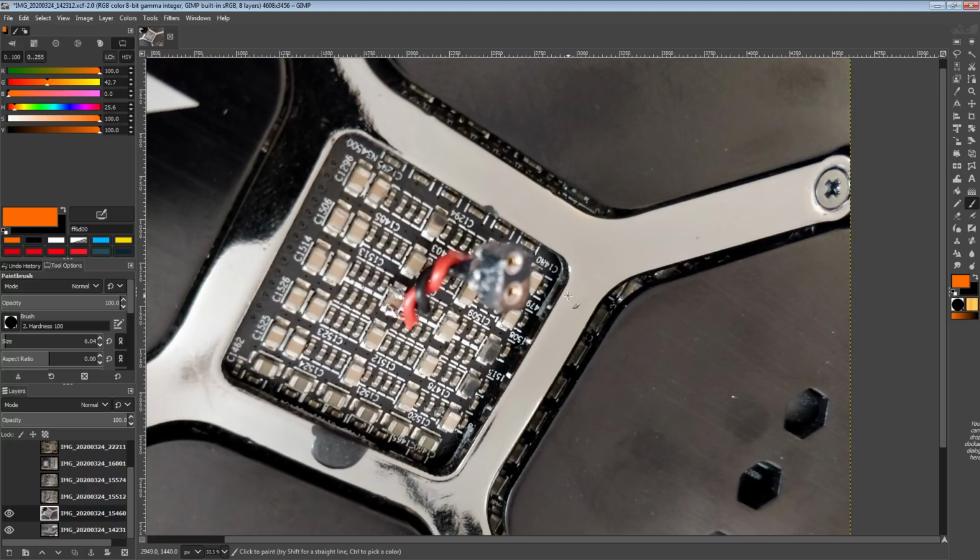so your measurement is just completely way off in terms of voltages. This is also a bit off in terms of voltages because I had a set voltage of 1.2 volts, and on the back of the core we're measuring like 1.21 volts, which is a bit too high. It shouldn't be measuring that high, but that's a consequence of the fact that I'm using a passive probe instead of an active probe. There is a workaround for that, but I figured that out way too late into the test data.